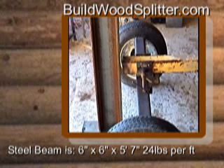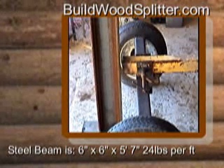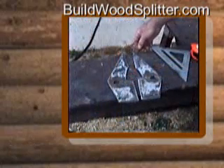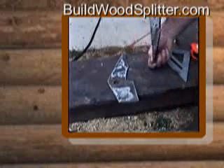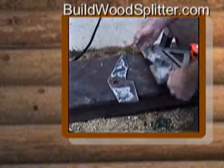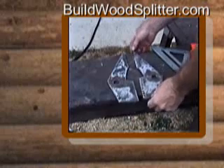So we'll go ahead and make our lugs up to go on the side of that. We can always change this if we want to. What we've got here is some lugs that I'm going to make some pivot points for. That's going to weld on that beam just like that, and then there will be a pin through it, and the beam will pivot on it.